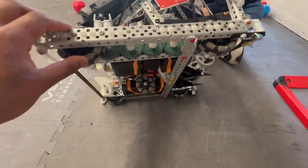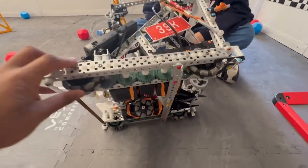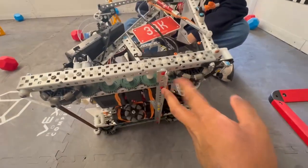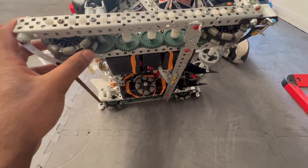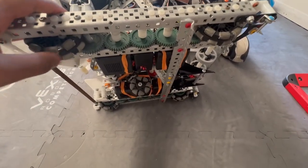I'll start off with our explanation of our drivetrain. We went for 600 RPM because, you know, speed — I like speed. And basically we only have two wheels on each side. The reason for this is literally just to save weight, because extra wheels is extra weight. We didn't really see any issues with sinkage in the ground just because our robot was so light.